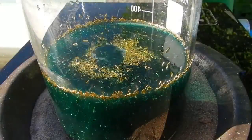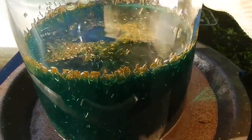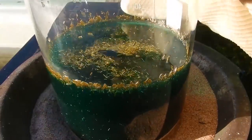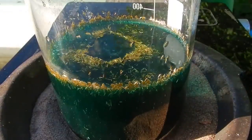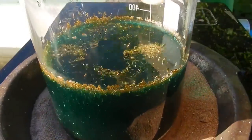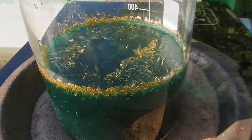The reaction is over. All metal is etched away. All the gilding does not sink to the bottom but is located in solution — it is very light, there is no metal anymore. The electrolyte consumption was 125 milliliters; nitric acid took 60 milliliters. Now I will dilute with water, put it to cool, and we will catch the gilding on the filter.